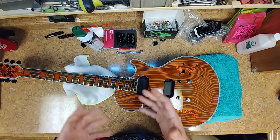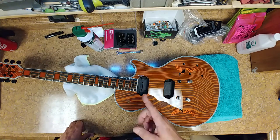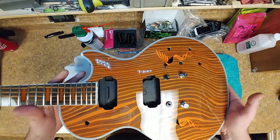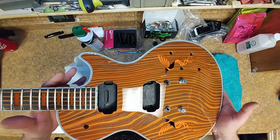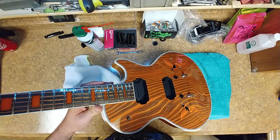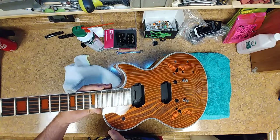This has been a great build. Other than a few little problems here and there that I had with the clear — getting this milky white underneath the clear — which I'm wondering if it has something to do with the sanding sealer that's on here. The body came out pretty good. You can actually see the dots in the cover for the fluorescent light. Fluorescent lights can play tricks on you — they could be your friend or your enemy when it comes to a finish. I noticed two little tiny dimples, one there and one there.